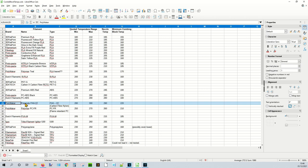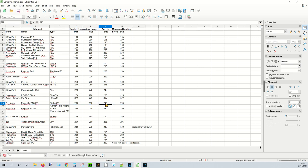Polymaker Polyamide PA6 Carbon Fibre — carbon fibre nylon — is probably the most extreme one. It needed a 290°C nozzle temperature (middle of the range) and the combining block had to be up at 220°C for reliable extrusion — the worst case overall. Another Polymaker, which is flame retardant polycarbonate, was very strange stuff — as it came out of the nozzle it seemed to expand a bit like expanding foam. Temperature range 250-270°C, set to 260°C, required 210°C on the combining block.